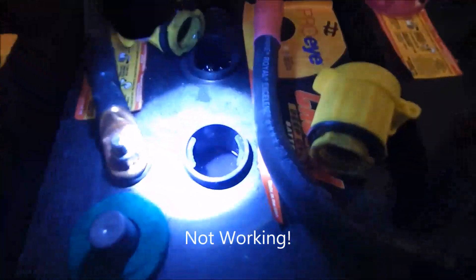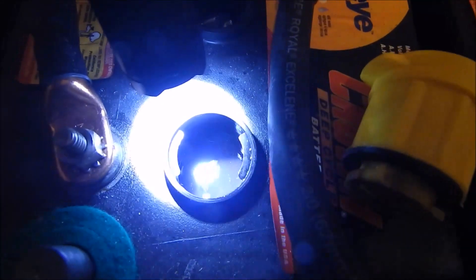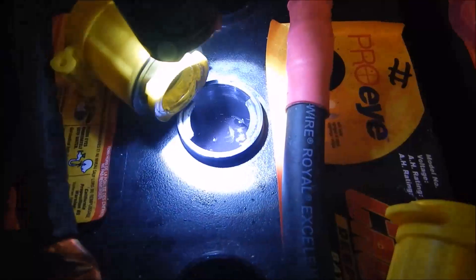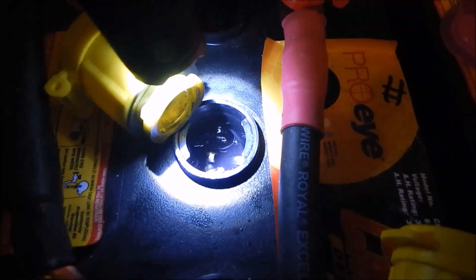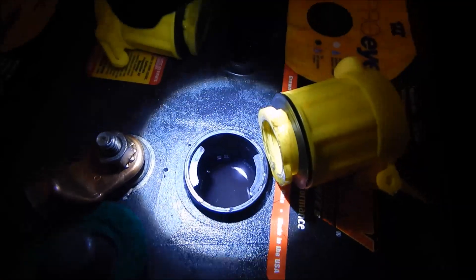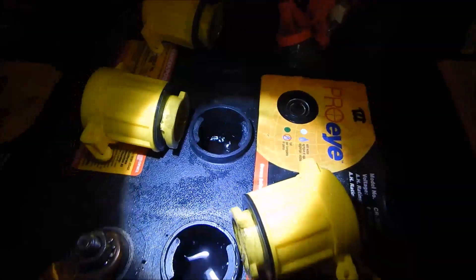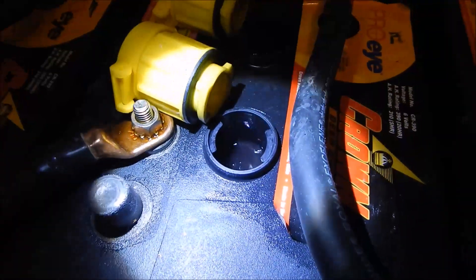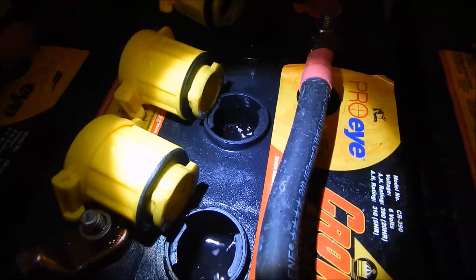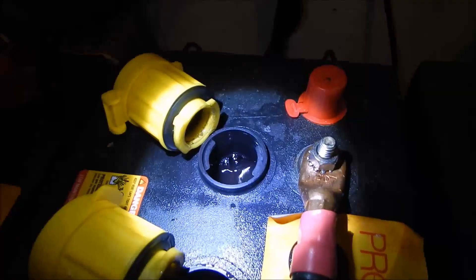I'm going to try to show you what the water looks like — it's real dirty and muddy, then when it settles down it clears up again. I'm going to do the EQ again today and hopefully get all cells back up in the green on the hydrometer. I'm definitely not going to wait every two months like I was doing, because obviously that just doesn't work.